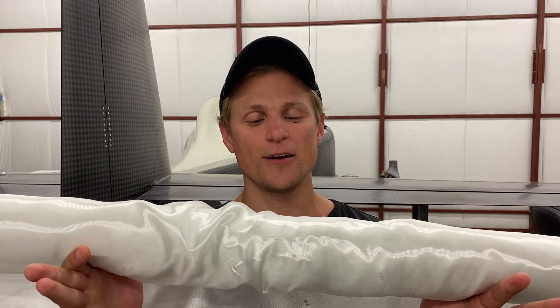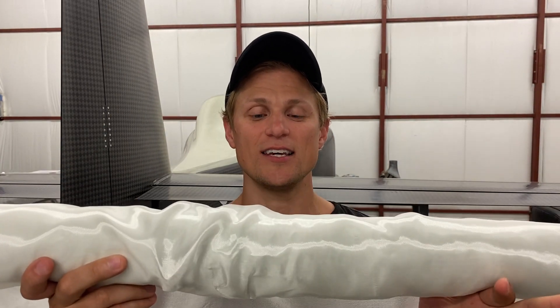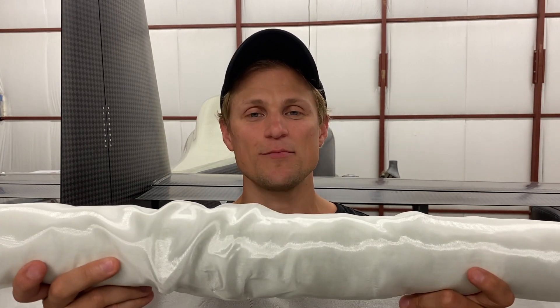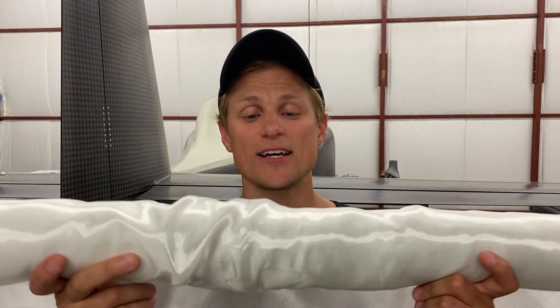The nice thing about fiberglass is that it's relatively inexpensive. It might be nice to use it more in the airframe, but it's not nearly as light as carbon fiber and not nearly as stiff. The second type of fiberglass we use is this thin, light fiberglass weave, which primarily gets used to prevent galvanic corrosion. There's a phenomenon that can occur between conductive metal alloys and carbon fiber where the conductive alloy corrodes. You can prevent it by electrically isolating the alloy from the carbon fiber, so we use this weave for that purpose — in the carbon fiber and aluminum honeycomb panels, we put a layer between the aluminum honeycomb core and the carbon fiber skin, and in other areas where aluminum alloy might otherwise touch the carbon fiber structure.